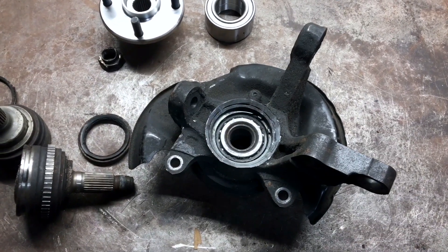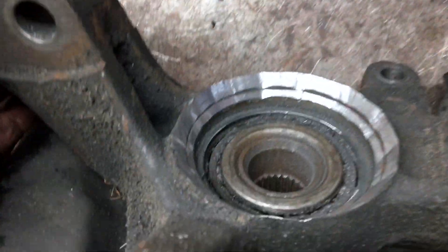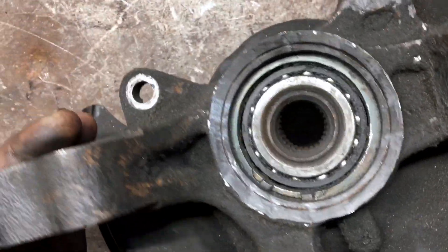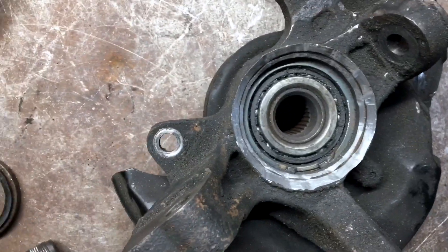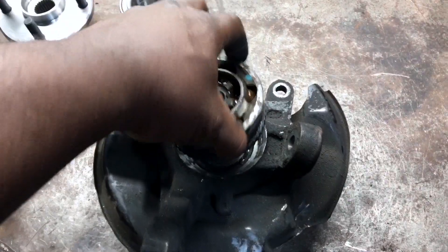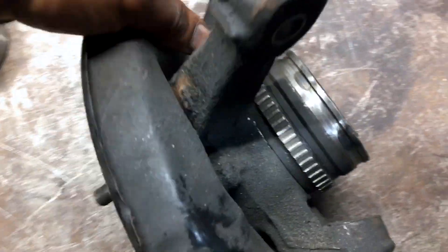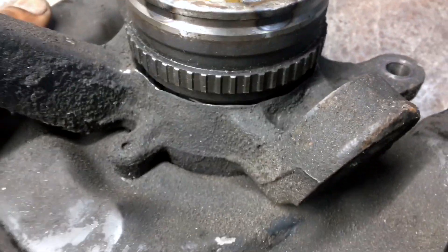Here's the finished product of me grinding down the back of the hub. Took off a little bit of material all the way around so the axle goes in without binding on anything. Now we can finally put the axle in and get everything to work the way it should. You can see the clearance we have now - that's what we're looking for, it doesn't touch or bind against anything.